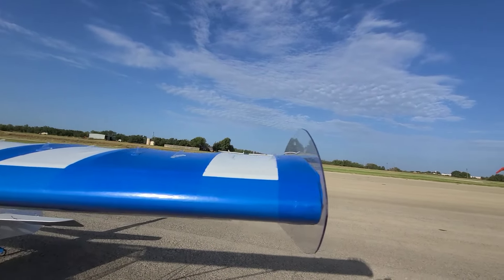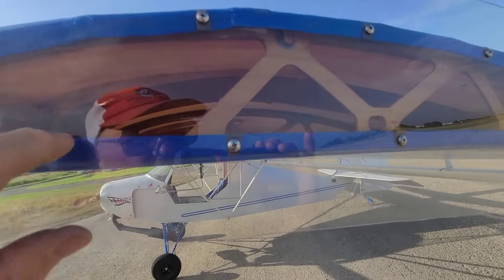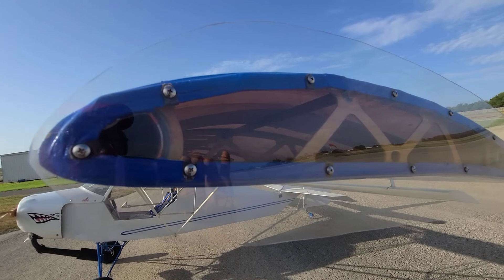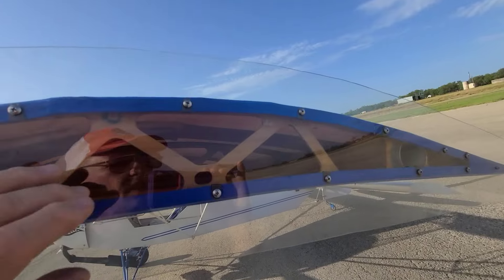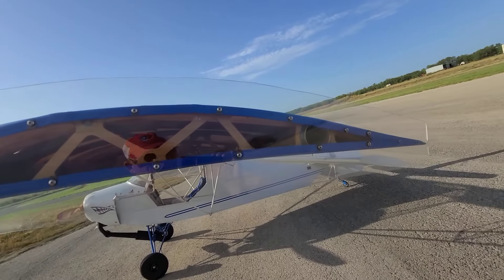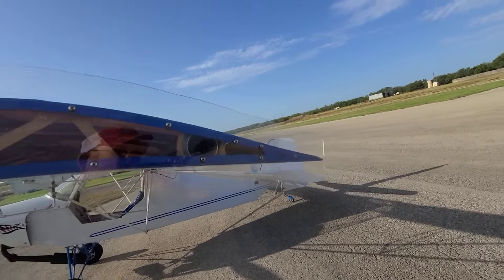...Lexan wing fences. They're put on with nut plates and screws, and on the end of the wing rib to get a mounting surface I used Lexan angle drywall corner protectors to make the angles, then wrapped the fabric around it. It's all glued in nice and solid. You can see it gives a nice look down the wings so you can watch for any structural problems — mostly bugs, mice, or other critters getting inside the wing.